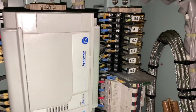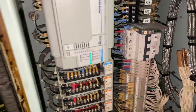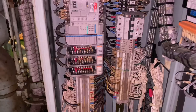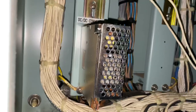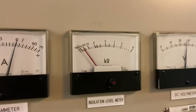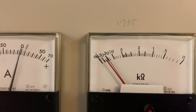I decided to switch off the control panel. To switch it off, you need to put the system into local and then you can drop off the breaker. I did this for both generator number three and number four. After doing that, the condition remained the same, but I kept generator number three and number four in the off position.